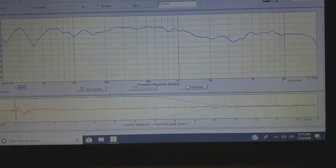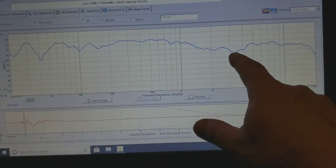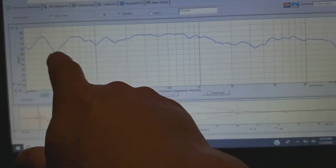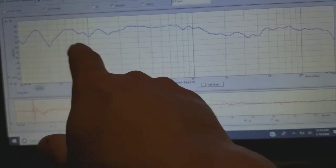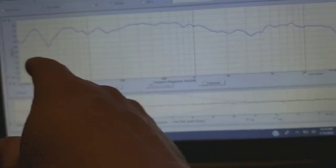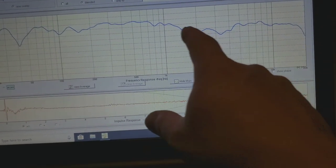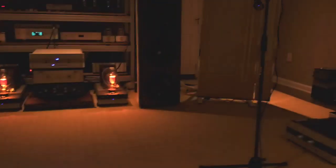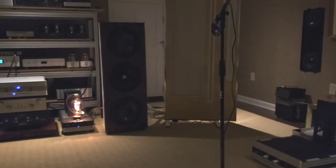Okay, so what we're seeing here — there's a dip here. This is to be expected because this is the low frequency; it's not really reading that very well anyway. Anything from here down you can ignore. This is all over the place. We are kind of far from the speaker, so we could be hearing the room in this.